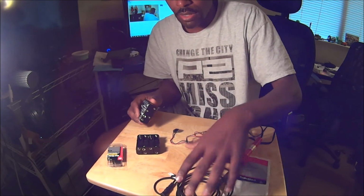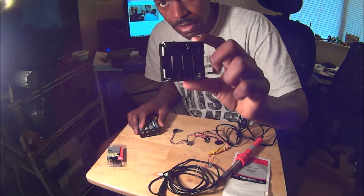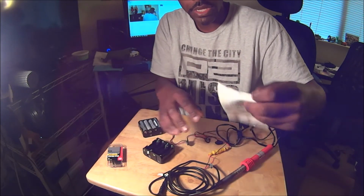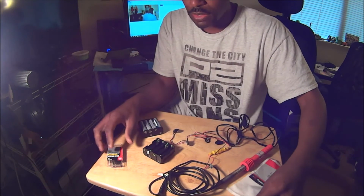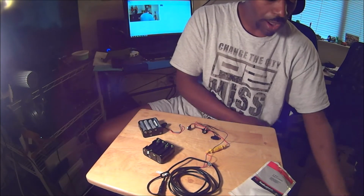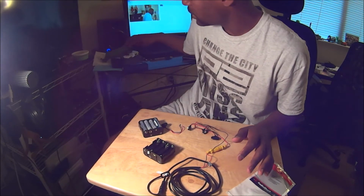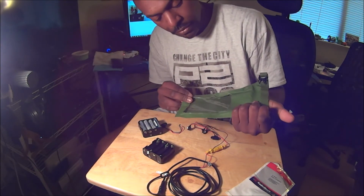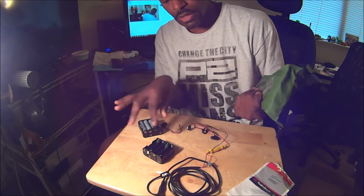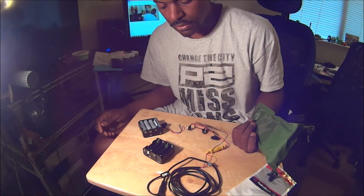Like I said, these are the components I use. Just this little battery pack for 8 batteries, 9-volt connection at Radio Shack, and these little snap connectors. The heat shrink and the soldering iron is not required. It just makes for a much cleaner setup. And I keep it in this dry bag because for this solution, all of this is on the outside of the kayak or boat or fishing vessel.